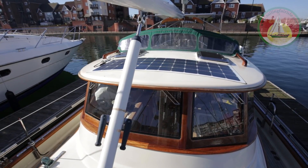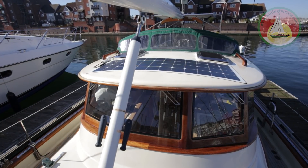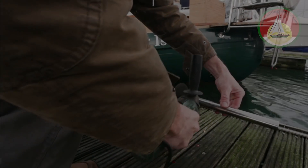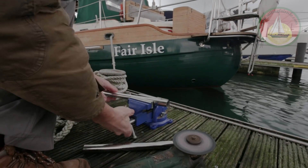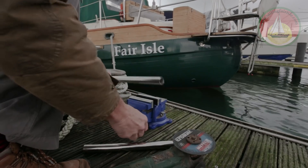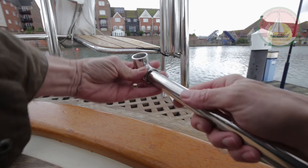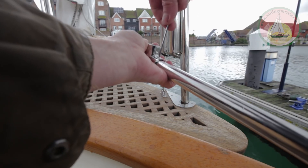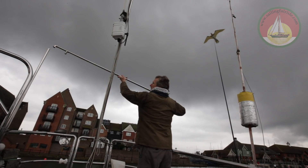If you look at tests on the internet you'll see that a thin line from standing rigging won't take the panel down too much, but shade a whole cell or more and you'll lose about half. So putting the panels across the stern and out of the way of the boom makes sense. That involves making a stainless steel frame strong enough to hold two large panels which may not weigh too much but represents quite a bit of windage, so we need a robust frame.